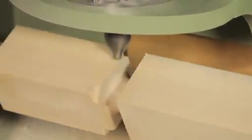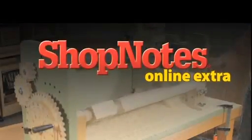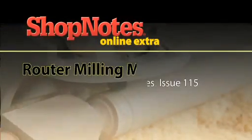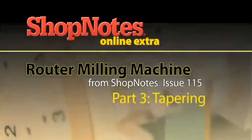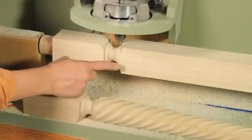The process of creating these shoulders is the same: make progressively deeper cuts as you route the shoulder on one side of the cove to final depth. After repositioning the router, you simply repeat the process to complete the shoulder on the other side of the cove. That takes care of completing the shoulders.